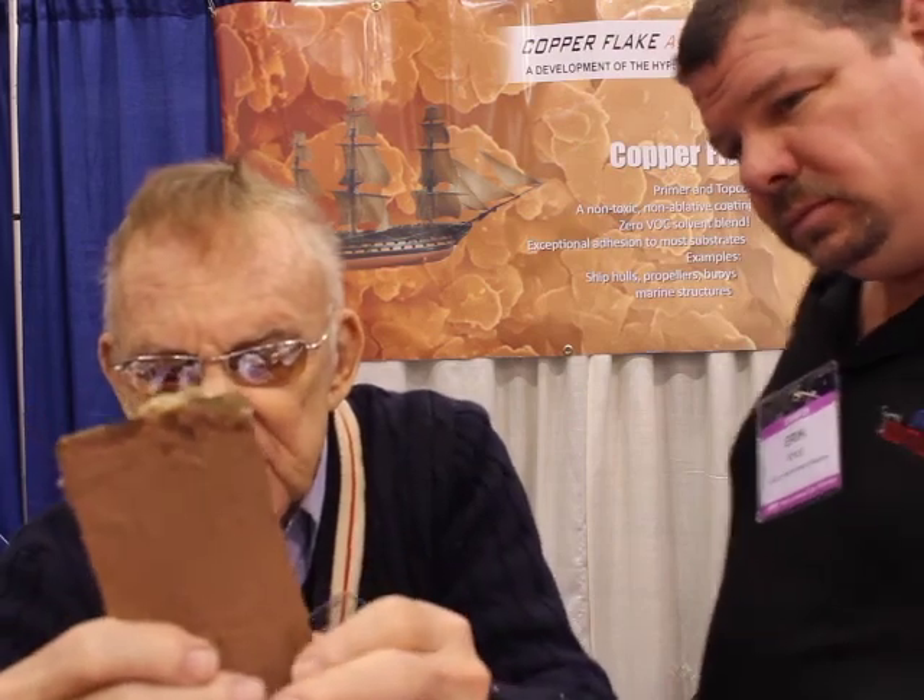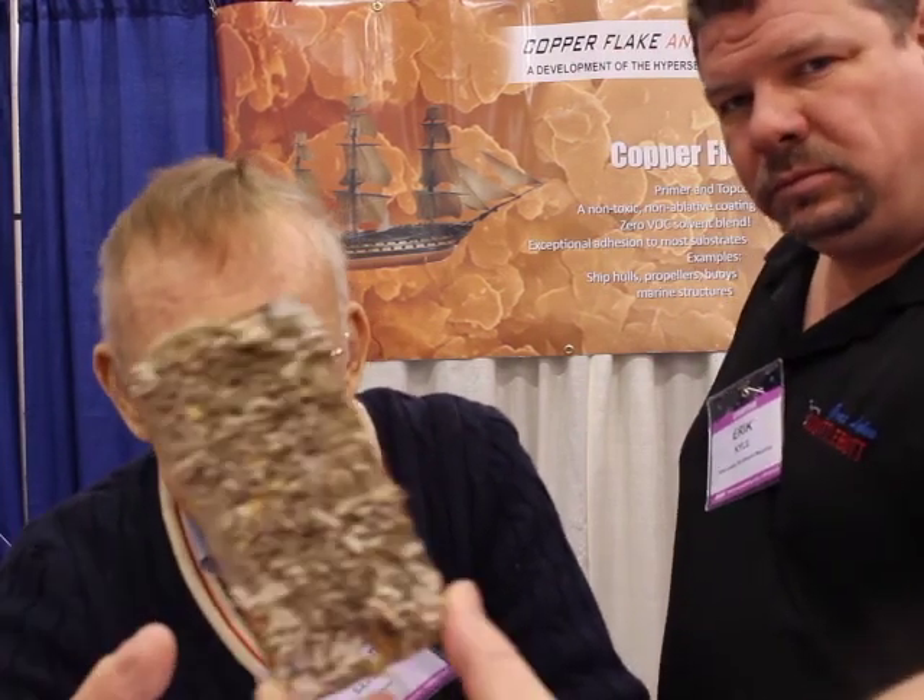The next thing I did was 16 months of testing in Aruba, the Salton Sea, and Sweden. The results are pretty much like this — with one side after about 15 months, the copper is basically unaffected, while the other side is covered with barnacles. We did about 200 panels, and this gives you an idea of the appearance after one year in the Salton Sea, which is one of our dirtiest environments.